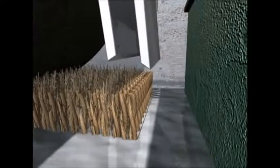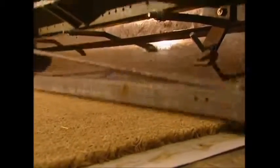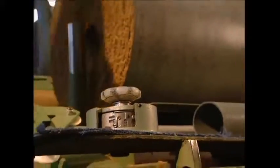In the case of this doormat, the fibre lengths are cut to about 60mm — the perfect height for cleaning a pair of trainers or muddy hiking boots. The fibres are pressed to make sure they're seated firmly, and the whole glue-fibre combination is then passed over a large heating plate. This hardens the glue and seals the bristles into place.